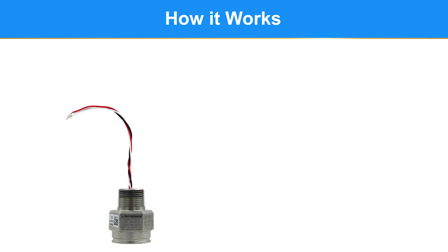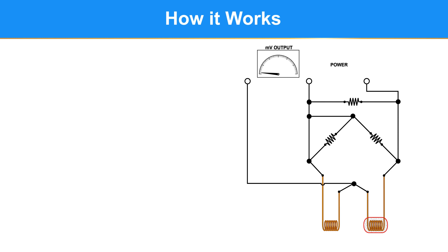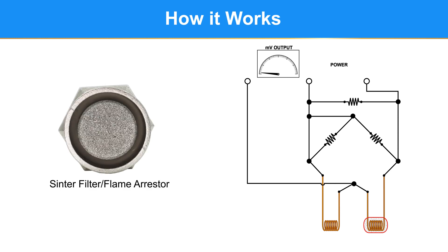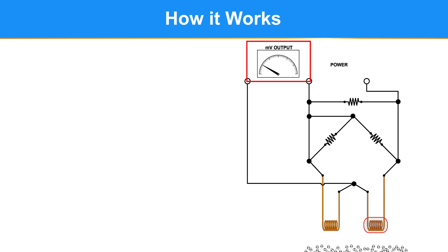The technology uses two platinum wire wound components — platinum being a metal that changes resistance when heated. One component is encapsulated with a catalytic compound, one is not, and they are part of a Wheatstone bridge. The two components are heated up to 500 degrees C when power is applied. When a combustible gas migrates through the sensor's sinter filter, it comes in contact with the two elements. One will change resistance differently than the other, which in turn changes the millivolt output of the Wheatstone bridge. The CGS interface board converts that millivolt output to a usable form for the UD-10 display board.